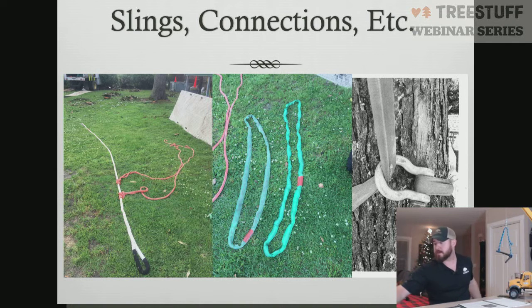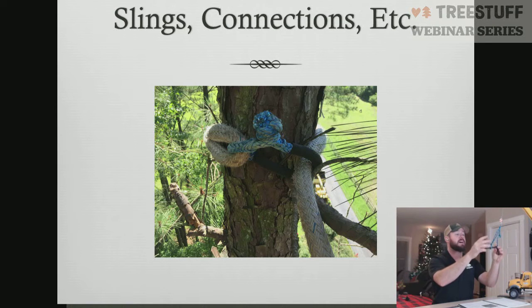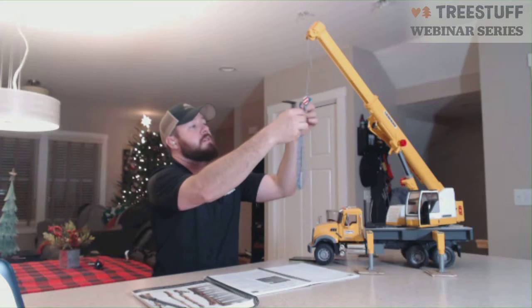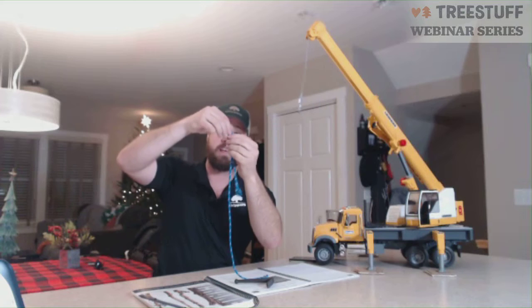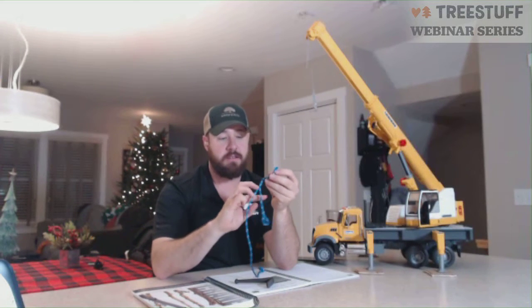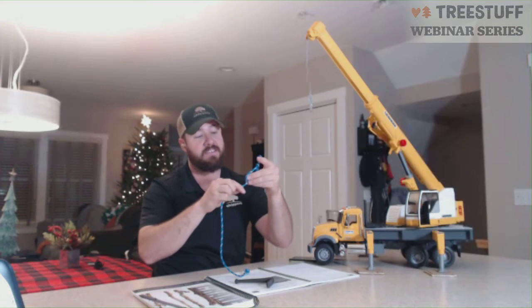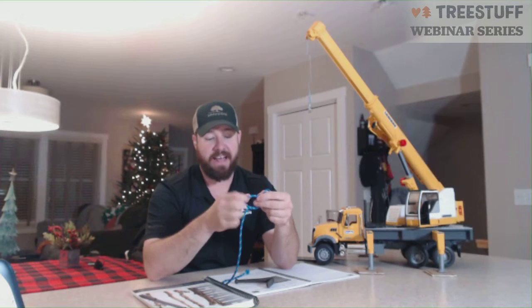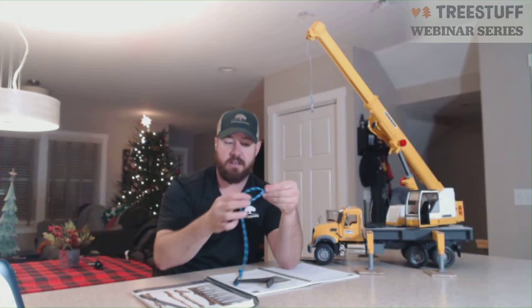All right. Also, we have soft shackles. A soft shackle is a rope product that has a whoopie-style loop on a round piece, and then has a knot on the other side. I'm going to try to do my best here to show what that would look like. If I slide this all the way down, I've got my end here. If I were to pass this through here, and this was my knotted end, and then I tighten this down, this knot can't pass through because all of this has friction on it here. Say it's not a loop, it's a knot. That soft shackle now can't pass through here. That creates the soft shackle.